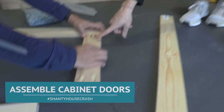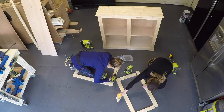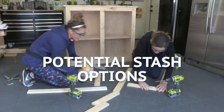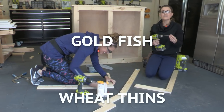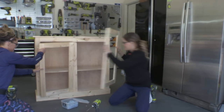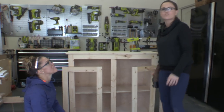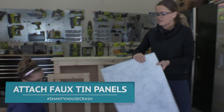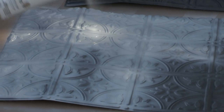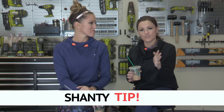Now it's time for the character of the piece — the doors. We're making these doors with one-by-three boards, attached using one-and-a-quarter inch pocket hole screws through the shorter boards and into the longer boards. This doesn't just have to be used for coffee — you can stash other stuff inside, like candy bars, goldfish, or even make it a wine cabinet. Door frames are built — check them for size. Now on to the panels: these are faux tin panels. They come black when you order them; we added white spray paint and will distress them later. Make sure you stain or paint those door panels before attaching the faux tin panels so you don't get stain on them.